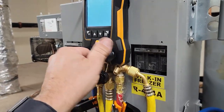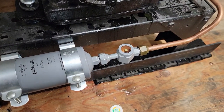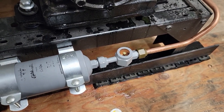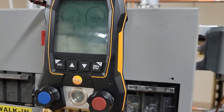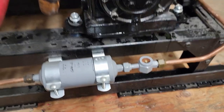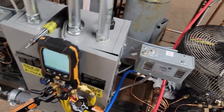Right here at four pounds, it looks like we started to go. Right now what's going on is the headmaster outside is starting to open and close because our pressure's finally gotten up high enough. It's a 180-pound headmaster out there. Just went through solid, which doesn't mean a lot — at about 12 and a half pounds. I'm going to stop for a minute and see how it does because we've got to give it a chance to get those evaporator fans on. So you're going to shut down on me already? I'm going to have to go look and see if it went into a defrost.